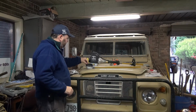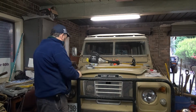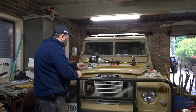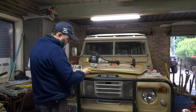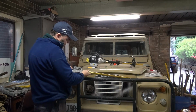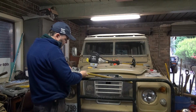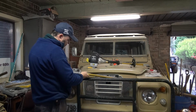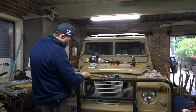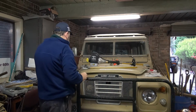First of all, we have to remove the nut. Take this cover off. Let's see here that it has a sprocket, as you'd expect. An adjuster screw here for adjusting the chain in and out. You see that's fairly loose, it doesn't fix in as such. I don't know whether it's supposed to. It looks like it's supposed to be fixed in there so it doesn't move in and out. In fact, it could be a manufacturing error, but we'll have to wait and see. When we put the chain on, we'll check that. If so, then I'll have to send that component back. Let's put the chain on and see what happens.